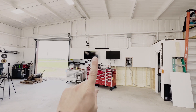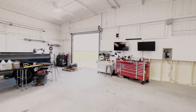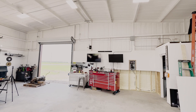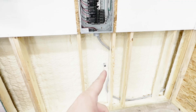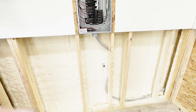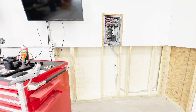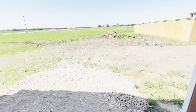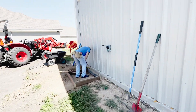What I'm thinking is we can mount the air handler right here in this space. I bought some unistrut, I'm going to stretch it across those two uprights, which will give a good solid mounting point for the air handler. I've already punched a hole in the wall here for the disconnect outside, so I'll run power straight from the box through that rigid conduit out to our disconnect box.